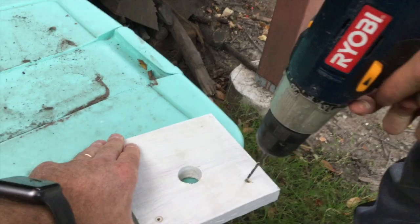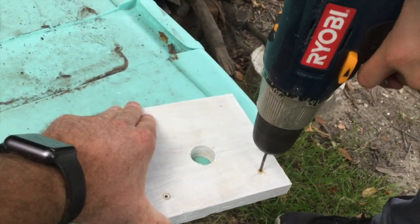Then I wanted to prime the wood before I put it in, just to make sure it had the best chance at holding up over time. I went ahead and drilled a temporary screw in the back, not going all the way through, and then came in with some exterior primer and made sure I painted everything. Eventually this will get touched up with some trim paint, but I wanted to make sure we protected as much as possible.